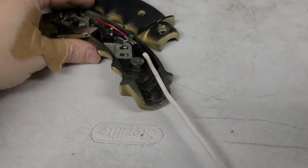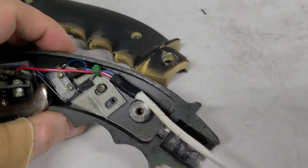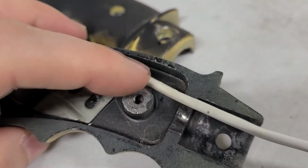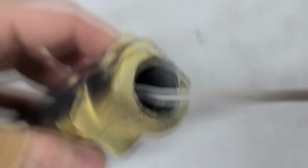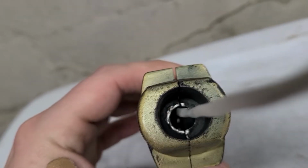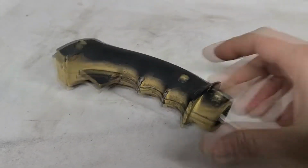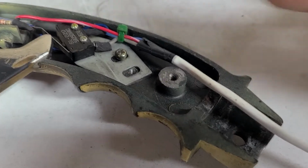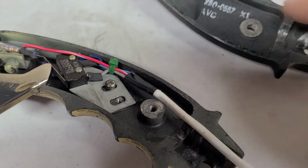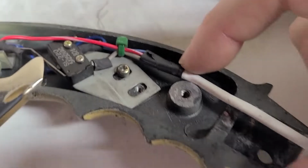So once I got the joystick pulled off here, you know, this section right on this sort of metal area would, over time, when you put this together, if you look in there, it's kind of hard to see, but it actually fits pretty loose, which means that as this joystick moves back and forth, it's gonna rub on those wires right here. Even if, for example, this might come up and go in between this section in here, because these don't come flush. So there's a screw that comes through, and that's how I think the wires got damaged.